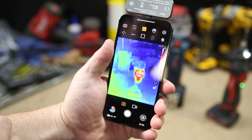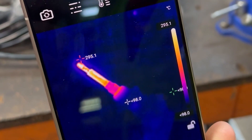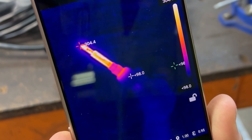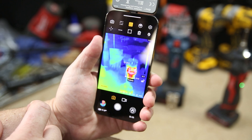The interface in the app is really easy to use — in fact I think it's quite intuitive. Right in the center you've got a bullseye; whatever you point that at, it'll tell you the temperature of what's in that bullseye, but it also gives you in real time the highest and the lowest temperatures. You can add additional bullseyes, move them around, and you can even do line and area measuring as well.